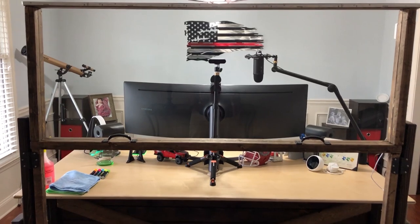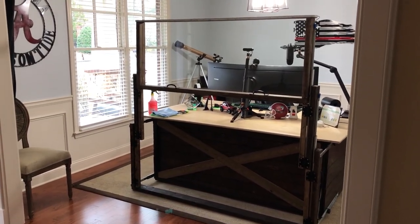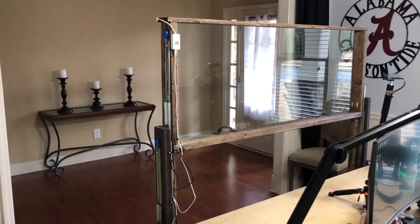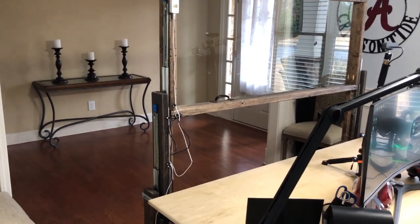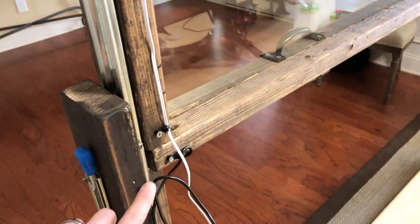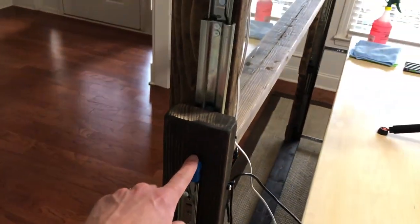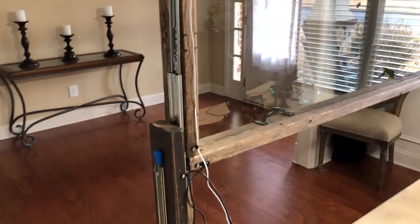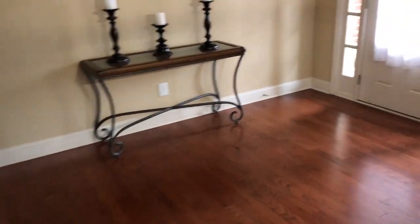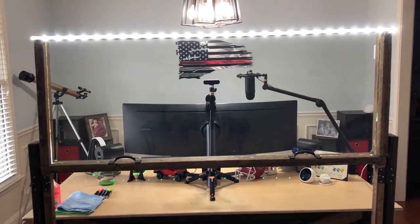With the setup fully extended you can see it comes out to perfectly eye level so you can write on it comfortably. Back inside the office, wire management is tough when you have a moving mechanism, but I managed to use double-sided tape to secure the LED module with enough slack for the pivot. The drawer sliders are also locking sliders, so not only do the wood supports hold it up, but the sliders lock vertically as well — the thing is super secure.